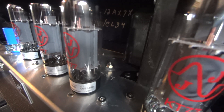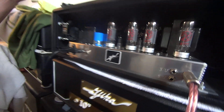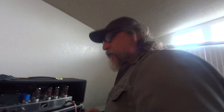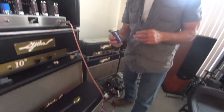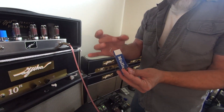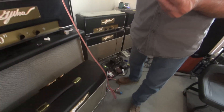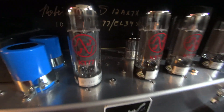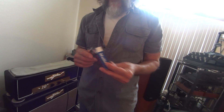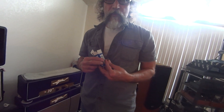This adjustment is only needed when switching to vintage tubes or the long-plate Russian tubes. Some JJs last two or three years, some don't. One important note: in the Gain Master amp, these larger-bottle tubes physically don't fit — the glass bottle is too big. So in the Gain Master you must use JJ or vintage 12AX7 tubes. JJ tubes are also bigger than stock vintage tubes, but the long-plate Russian tubes are even larger and simply won't fit.